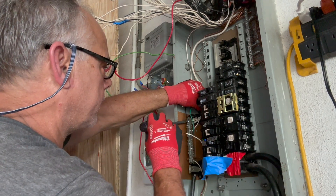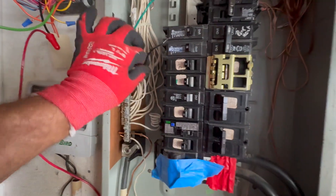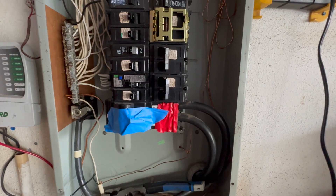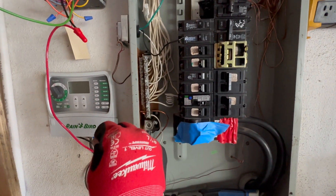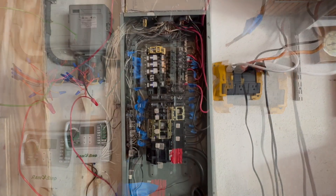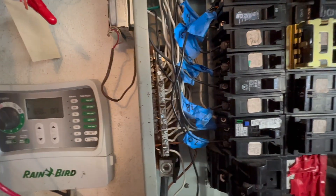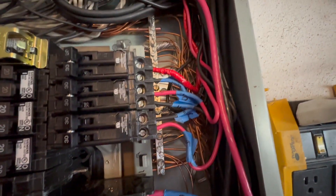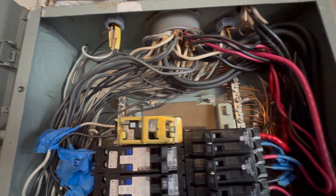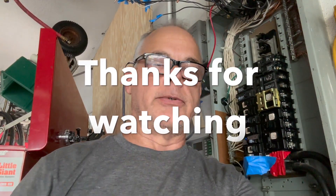I'm going to do that after I install the transfer switch. All right guys, I have all the neutral wires tied in. I still got all my hot wires to run and I'll do that right now. This will no longer be bonded once I hook the transfer switch up, because the transfer switch is my first means of disconnect to the power to the house. That's why we isolated the neutral. All right guys, there's what it looks like all buttoned up. I'm glad I marked these because there's all your neutral grounds and there's all your earth grounds. It looks about as ugly as it did before — not too bad. Well, I hope you guys liked this video. If you do, like and subscribe, give me a thumbs up.